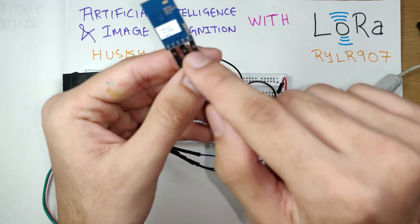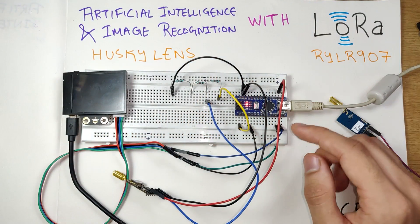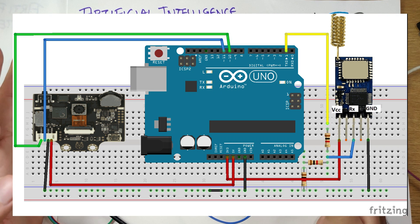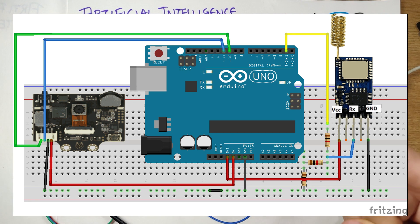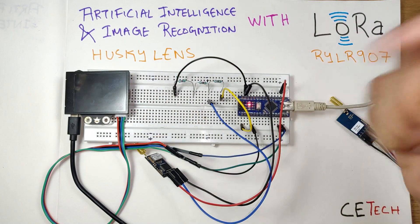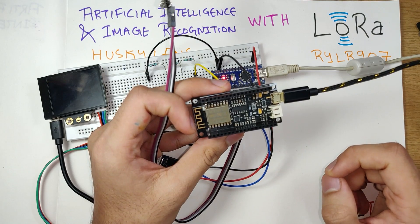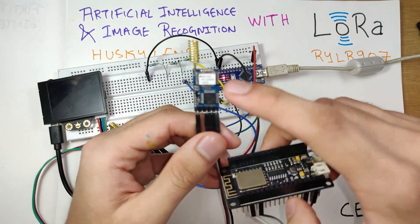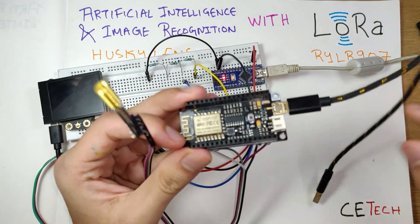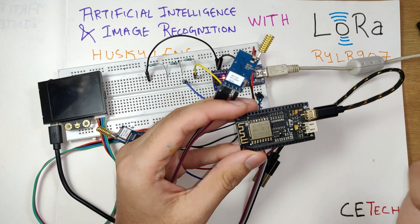One pin of the serial port of the REYAX module is connected to the Arduino through series resistors acting as a voltage divider, since the Arduino is a 5V logic level device and the REYAX module is a 3.3V logic level device. The circuit diagram is pretty simple — you can hit pause and take a detailed look. It will be available on the Instructables and GitHub page linked in the description. For the receiver, we are using an ESP8266 FireBeetle from DFRobot directly connected to the same REYAX RYLR907 LoRa module — the same circuit and code as in the LoRa messenger video.